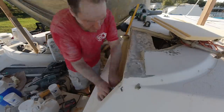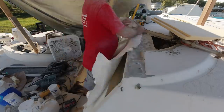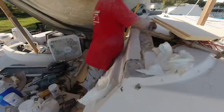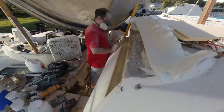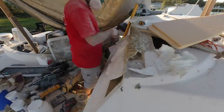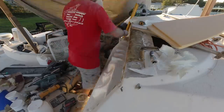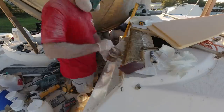You can see what I'm doing here — I'm putting tape on that wood so that it doesn't stick. All I had was masking tape. You know I should use packing tape, that does a much better job, but the masking tape works in a pinch. A lot of people leave comments saying you should use this or that or wax paper. I just kind of use whatever I have and it works pretty good. The masking tape worked fairly well but it left a little bit of residue when I pulled it off on the back, but it cleans up easy enough with acetone.